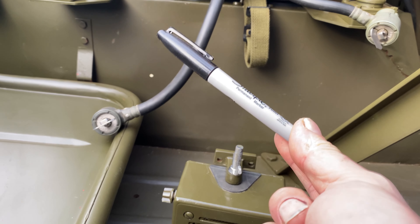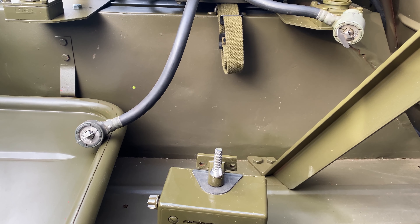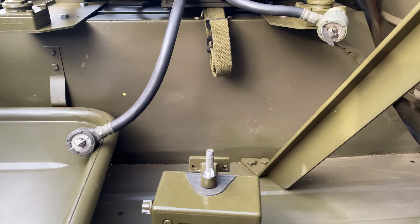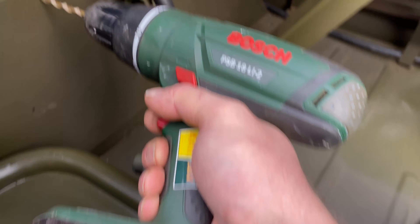I'm going to mark up the holes with a black pen, pin punch them, drill them, and then bolt it on. The holes have been marked — now I need to pin punch them, then a 6mm drill is going in. Not very easy one-handed.